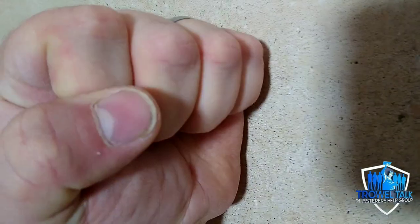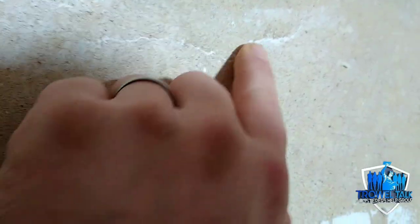I've got a 1930s semi here in Warwick. 90% of these walls are in sound condition. When I say sound condition, if you just make a closed fist and bang on the wall — or knock it — that pitch you can hear determines whether the plaster is shot or not. Most spreads will tap the wall and the pitch tells them whether there's any movement or whether the plaster is shot.